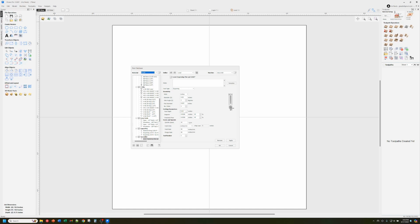On the pass steps, this is going to be a single pass, and I am going to set it very thin. I don't want to put 0, even though 0 would be okay for the laser. If I put 0 in here, then because the simulation still thinks it's an end mill, if I don't put some finite depth there, it'll simulate with a 0 depth cut, and it won't show up and you won't see it. So I just put 1/1000th of an inch. That won't change the focus of the laser significantly, but it allows the simulation to run.